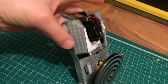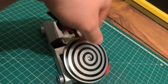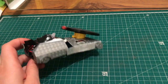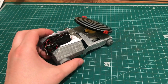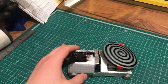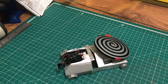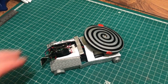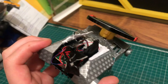Okay, bad news. The motor for the actual spinner doesn't seem to have died. It seems very nice and smooth. But you switch it on and it gives one ditch attempt at a pulse, one little spin, and then just stops really quickly. And also you can't drive it anywhere either. But if you put it into the middle mode without the motor on, then it's fine. Which makes me think the motor's shorting out somewhere, so I'm currently looking to see why that is.